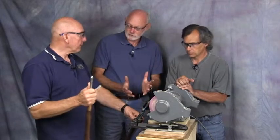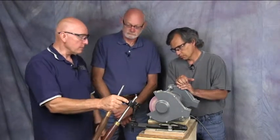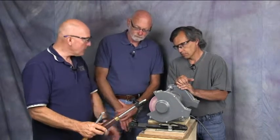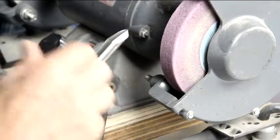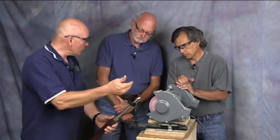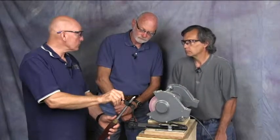That's our sharpening system — it's kind of unique in the market. It's the only one that captures and locks it in place like this. It has a rubber grommet here, which serves two purposes: being softer, it grips the tool really well so the tool won't slide in, and it's broad enough that it allows you to use even those massive bowl gouges as well.